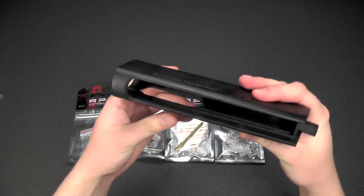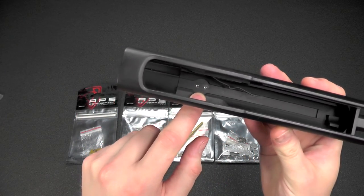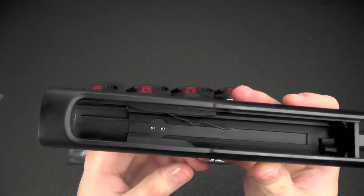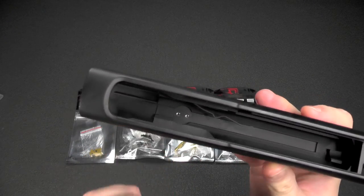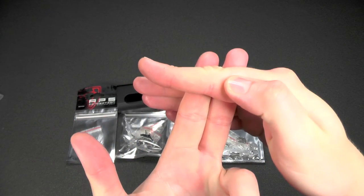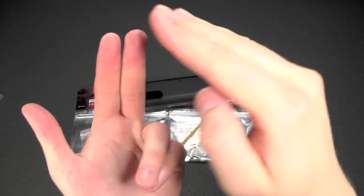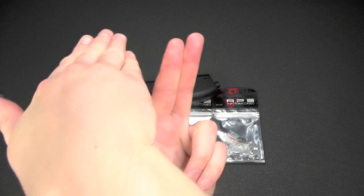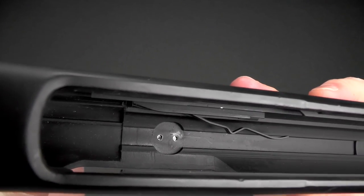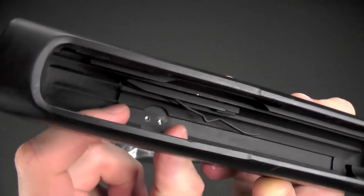And the other thing is, every time that you pump or rack the action forward and the bolt comes forward, what's making it stop is that plate right there. And so you can imagine, I use quite a bit of force when racking the bolt. So the bolt comes forward, the locking block has a little nub sticking up at the top. Let's see, this is the top of the bolt. It kind of comes up like this, and the bolt plate is here, right? So when it goes forward, I don't have enough hands to illustrate this, but basically that's the stopping power. So as you use this and rack the action back and forth, as you do on a shotgun, you're going to put a lot of stress on here. The good thing is that the fit of the actual plate is very tight, so there's not a lot of back and forth play.